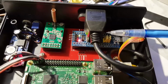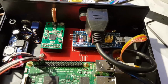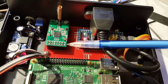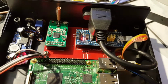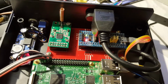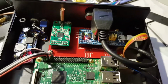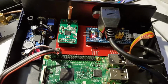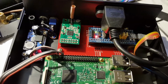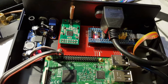Moving over to the back here, we've got our STM32 microcontroller, and this is really where all the magic happens. This is the ADF7021SE modem, and you see I've just tacked a small 433 MHz helical antenna on there, and that gives about 100 yards range or so. Of course, when the lid's on, everything's nicely tucked away inside, so no chance of snapping and breaking anything off. For the most part, people with hotspots tend to only use them around the house, and it's more than adequate for that. You probably even get to a few houses down the road and you'd still be able to use it.